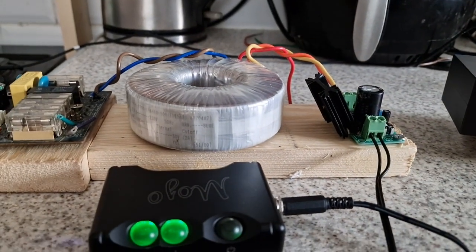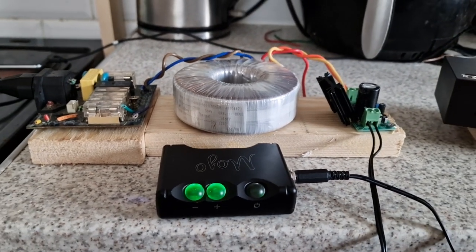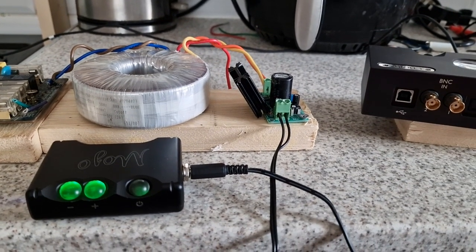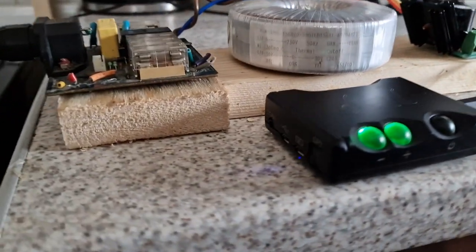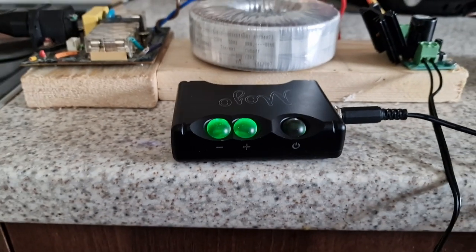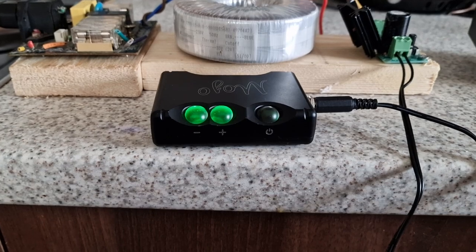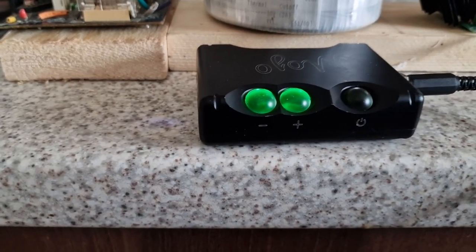I've got one here — it's the size of the one you'd use for a power amplifier. I like a big toroidal transformer. I've got it going down to 7.99 volts. I'd like to get it at 8, but once you know it's blue then you know you've got the right voltage. People say you need a 7.4 volt battery — that's true, but it gives off 8 volts, believe it or not. So it's 8 volts this thing runs on.